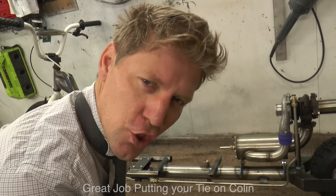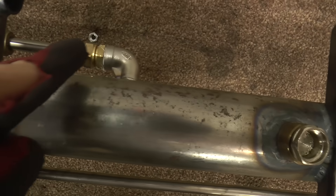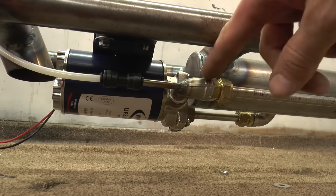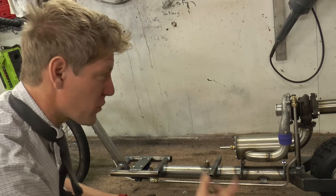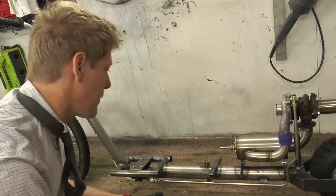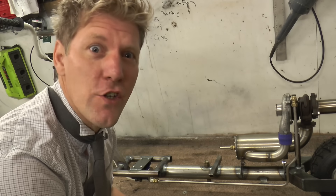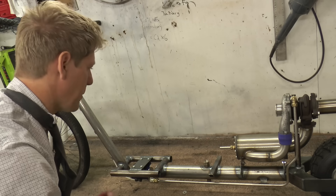Okay, let's give you a little tour of what I've just done. We have our oil reservoir — it's going to come out into the pump, pressured into the turbo. So I know what the pressure is. Little bleed-off pipe up to the handlebars with a pressure gauge. Now to regulate this pressure, because once the turbo gets hot the oil gets thinner and the pressure drops — you need to be able to turn it up a little bit. I've put a speed controller on the pump. I'm going to use an electric pump so I can alter how much pumpiness it gives. That's how I'm going to do that.